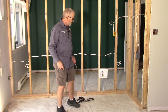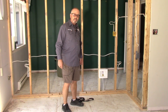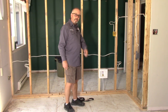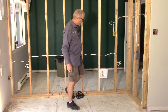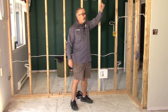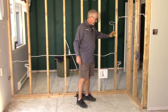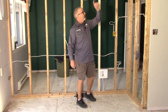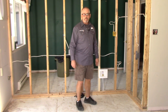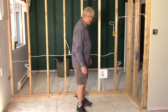Over on this side, right here is where the fridge is going — a 36-inch fridge with an ice maker and water dispenser. I put a box here and plumbed a water line over to under the sink with an angle stop, plus a shutoff valve right behind the fridge. For the fridge's dedicated electrical circuit, since it was in the wall that no longer exists, I pulled it up into the attic, brought it down through this wall, and over to the fridge location. The three-wire feeds from that wall also came back and I ran them down under the floor, where the junction boxes will make all the proper connections for the three two-wire split circuits.